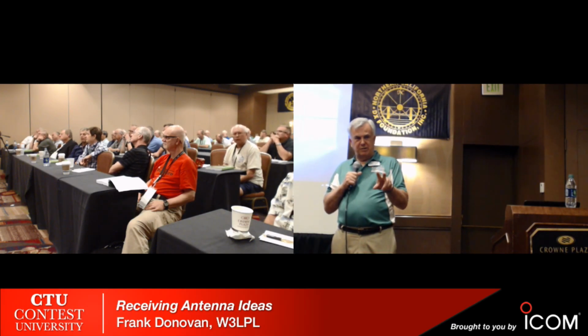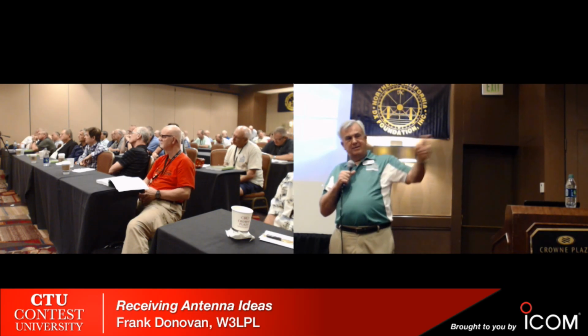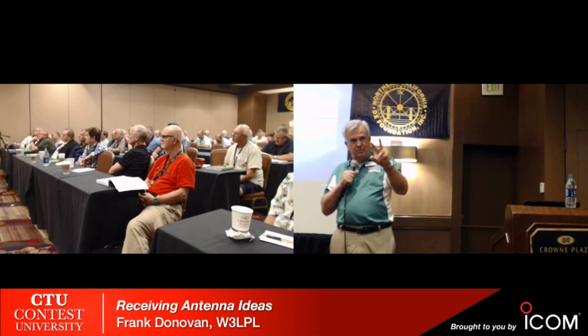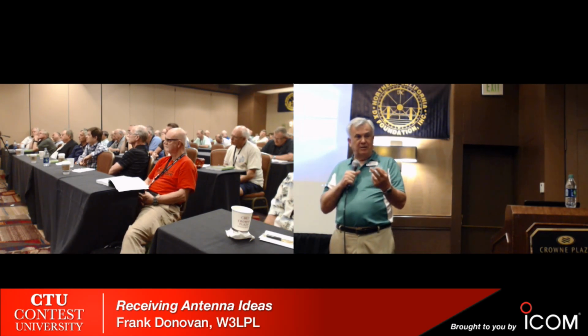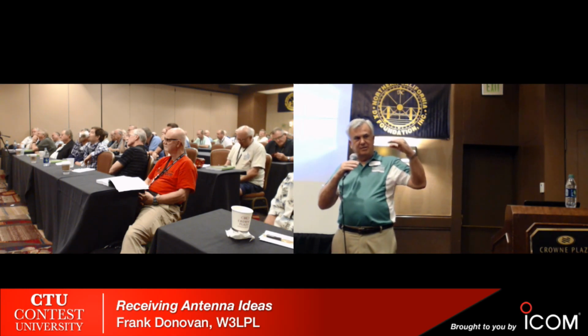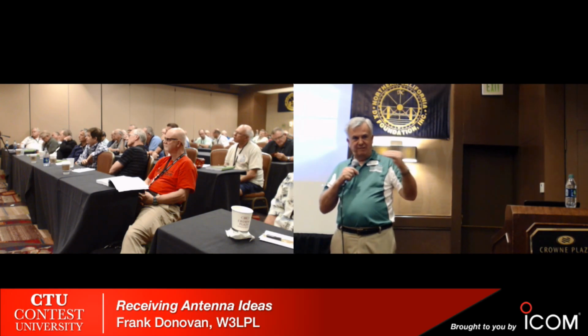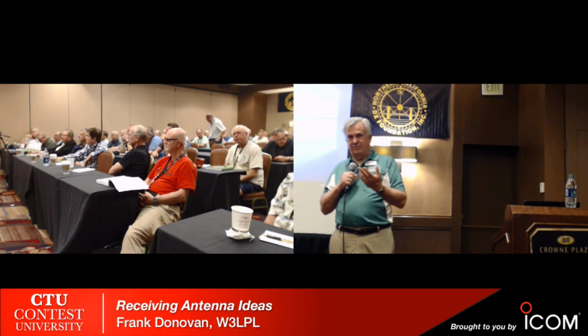But as soon as we went to simultaneous transmissions and two antennas that are co-located, a reference antenna and an antenna being tested, for example, a Yagi at 30 feet and then a dipole maybe 50 feet beside it at the same height, and then you compare those two. We have not yet begun to try to test antennas that are miles apart. We are going to try that. We're going to try to find some analytic methods that'll work, but I think it's going to be really difficult because what's happening when antennas are very far apart is the signals are traveling through different parts of the ionosphere. But when the antennas are co-located, where you have a reference antenna and an antenna under test, that works very, very well. But there's a lot more to be learned, and I'd encourage anybody that wants to get involved in this. A pair of Whisper transmitters is not very expensive, and then you can start getting involved in some of these tests that have just started.